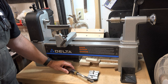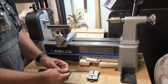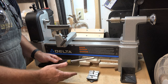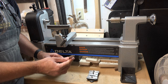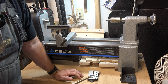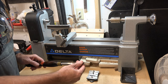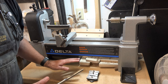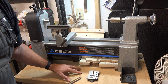If you had this spindle gouge sitting there and all of a sudden, for some strange reason, it got bumped and fell off of the bench or off of your lathe stand here, your first and initial reaction is to reach down and try to catch that. And then you've got this razor sharp gouge now. Well, let's just say you're heading to emerge to get a few stitches, and nobody wants that. So very important and so often overlooked, housekeeping, keeping a clean, organized, and clutter-free workstation.